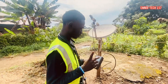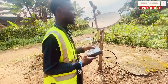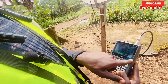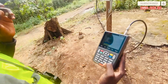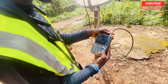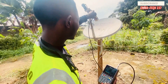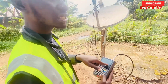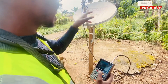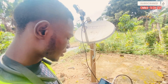I've got my signal for 5 degrees East, which is my Star Times. Look at the signal now — the LNB position is at seven o'clock. Take note: once you rotate the LNB, the signal will not be there. So the LNB position is seven o'clock precisely. We have about 70 channels here.